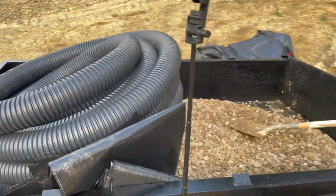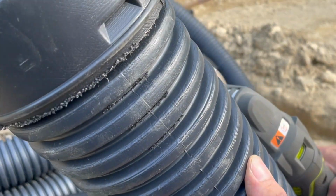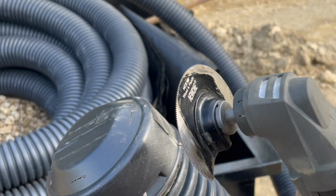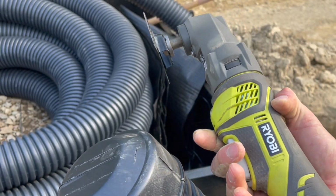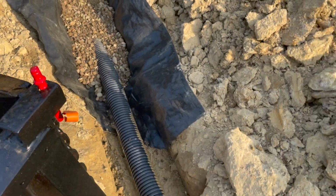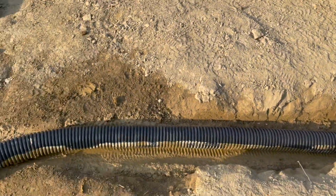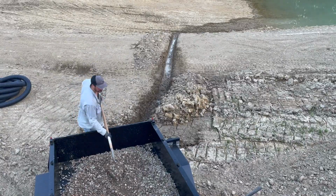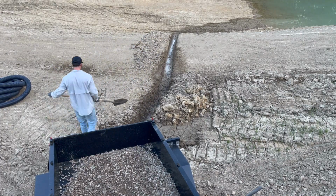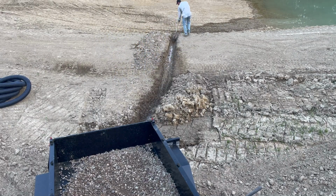But anyway, you will see what I did: I bought solid 4-inch corrugated drain pipe, and I'm perforating it myself because I only wanted a perforated portion laying inside of the spring ditch itself, like the French drain, and then solid pipe going through the breast and the swale. I did not want perforated pipe going through the breast of the swale because then it would always lay wet.